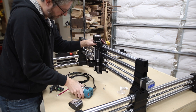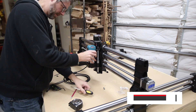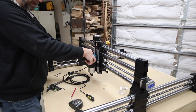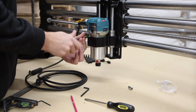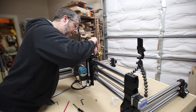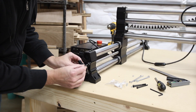Remove the cap from the top. I had to wind the gantry back down a little bit to make sure the trim router could fit into the collet — it was a really tight fit, so I grabbed a screwdriver to pry open the jaws just a little so the router could start to slide in. Slide it all the way down until it bumps against the housing. Note that the power button for the router needs to be facing right. Then secure it with the four machine bolts included. Onefinity cleverly gave you an extra slot in the cap for the router cord to go through toward the back of the gantry, so put it through that slot, reattach the cap, and plug in the motor.